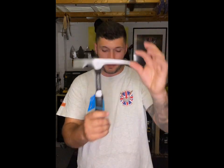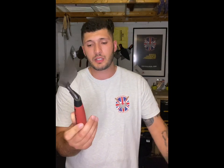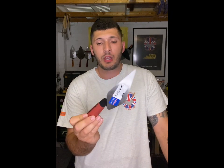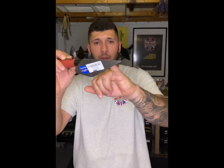The Marshalltown pointing trowel — this is an 11.5D, a narrow London pattern. Great bit of kit, there's many on the market but this will last you. It's 5 inches. You'll use this a lot for any flaunching, manholes, tiling courses, weatherstruck pointing — great pointing trowel. What I like about it is it's got a straight edge which means when you're pointing you can hold that edge along your brickwork and get a really nice finish.